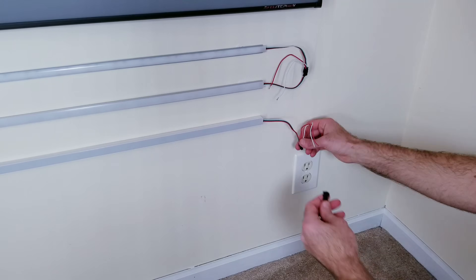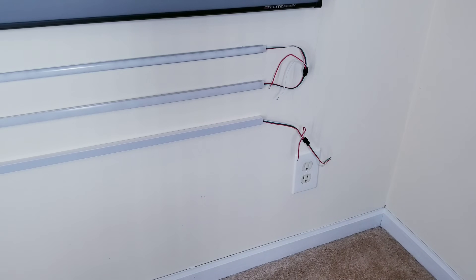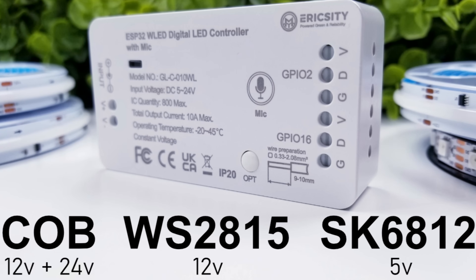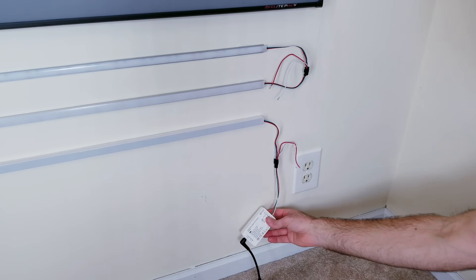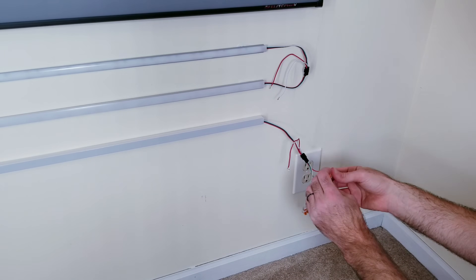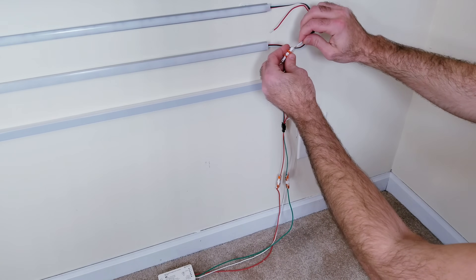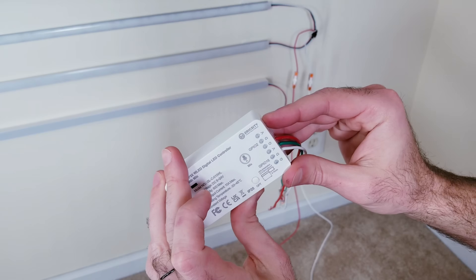For connecting and controlling these, I'll first attach the separate JST connector that comes with every kit to the beginning of our first LED strip. I'll be using a plug-and-play WLED controller that supports 5, 12, and 24-volt strips — I'll leave a link to a full walkthrough in the description. From here I can simply insert the ground, data, and voltage wires into the push connectors on the controller, plug it in, and you're ready to go. Since having the controller dangling isn't ideal, I'll add some WAGO connectors and longer cables for more breathing room. If needed, I can also quickly add a couple more WAGOs to the power injection wires and run those back to the controller's other ground and voltage slots to add additional power.